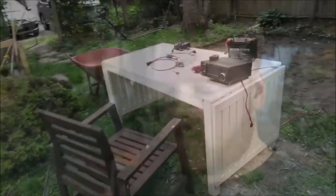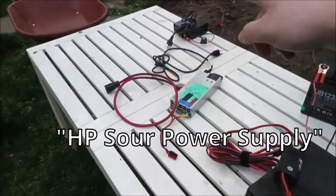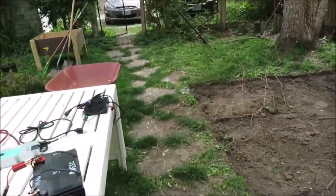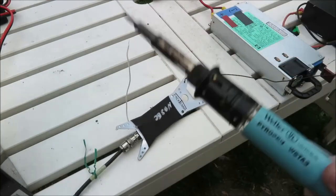So let's go to the backyard, throw an antenna in a tree, and compare the battery and both power supplies to see if there's any difference in the noise floor. Pardon the backyard — it's currently a construction site. The IC-7300 is out here along with the battery, the HP server power supply, and the Radio Shack supply. I'm using an end-fed half-wave antenna going up into a tree with a counterpoise going off to one side, connected to house power via an extension cord. I just noticed my antenna came loose — time to break out the tape.